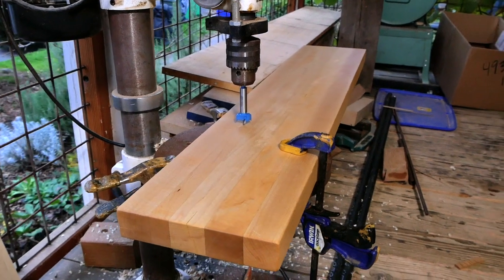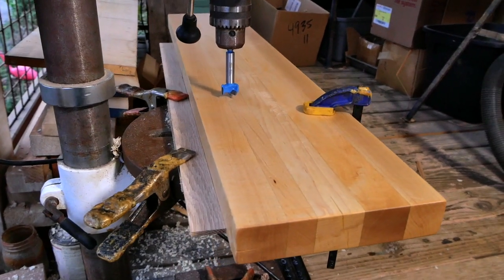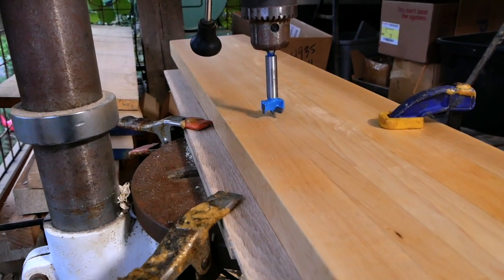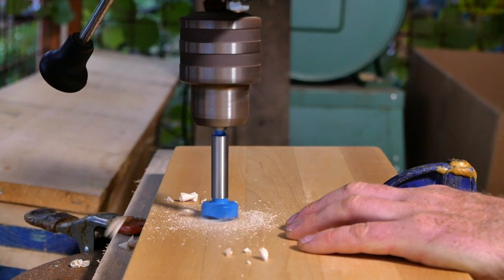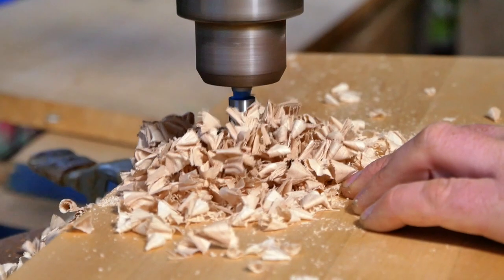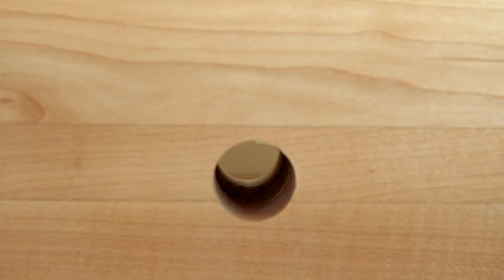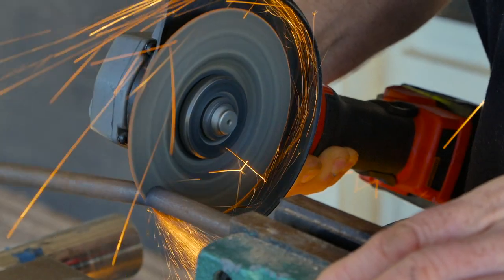I've set up the drill press with the large diameter Forstner bit and set up a guide rail along the back so all holes are drilled the exact same distance from the back of the shelf. All three shelves are drilled out and the holes line up perfectly. If you're off on any holes by more than a 32nd, you can take your Forstner bit and carve the edge of the hole to get everything lined up — that's the nice thing about working with Forstner bits, you can cut the edge of a hole.